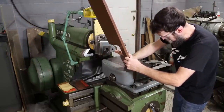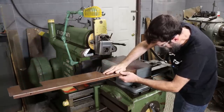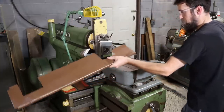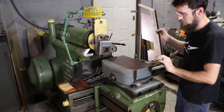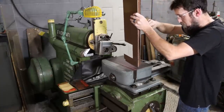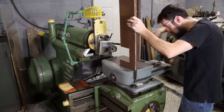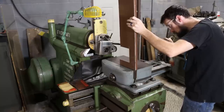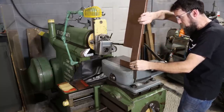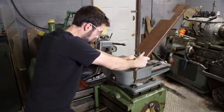So lucky for you, I lost the bandsaw footage. Actually, the file got corrupted of me cutting this piece out, but you didn't miss much because cutting sheet metal in a bandsaw is obnoxiously loud. Here I'm bending up the pieces in the vise, the bends that I can make in this vise anyway, which was probably 50% of the bends that needed to be made, and the others I just did the old-fashioned way with a mallet and an auto body dolly. It worked pretty well, actually.